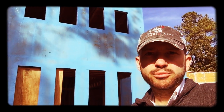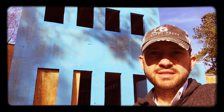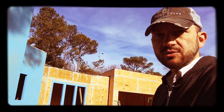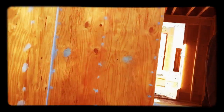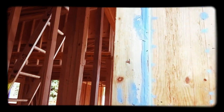This is a three-step process. This is made by Polywall — it's called their Blue Barrier System. The first step is to detail everywhere around the building with their 2200, which is a reinforced liquid membrane. Right here is where we're at that stage — this is the 2200, and this is the detailing that I'm talking about.